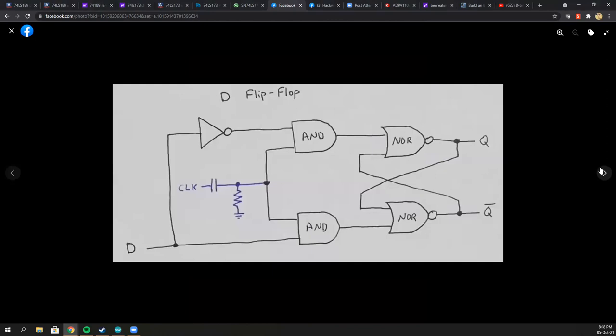After the clock and bus, the next concept is the D flip-flop. Ignoring how it fully works internally, the key principle is that when you put in data, the data stays in this circuit and gets output. To make it more functional as a memory — allowing data to cycle back to the same D flip-flop — we need to introduce a switch where you can load the data or prevent the data from being loaded. With that, you effectively get a memory cell.